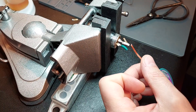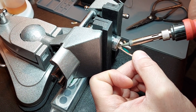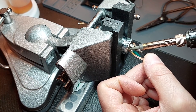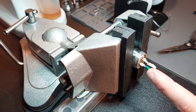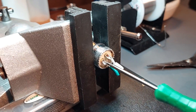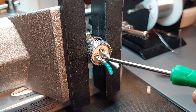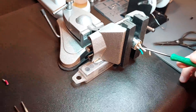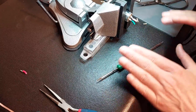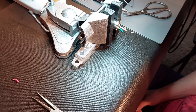You want to remove this piece and come down to a lower section. You see how tedious this is — rework takes time, not to mention all of the parts involved. I'm going to keep going, heating everything up, bringing in solder to get a contact point, and you'll see the chrome finish reveal that leftover residual solder is just not high quality. We keep going, taking it down, and I'll continue until this is ready to be re-soldered the right way. Inside that cup once again there's a big air gap — this was never actually seated as far as the conductor. That's what you get when conductors are not tinned properly with proper flux and high-quality solder.